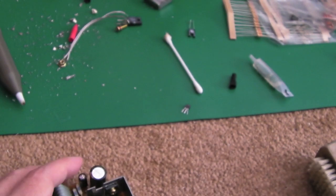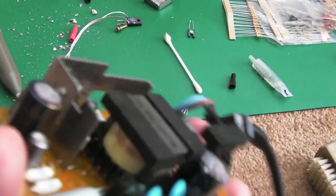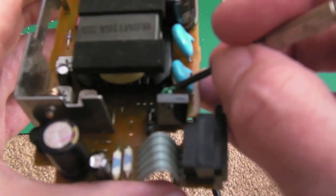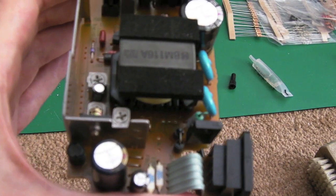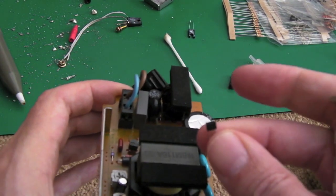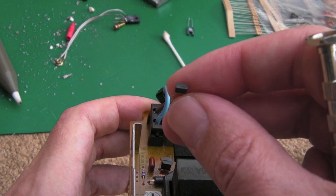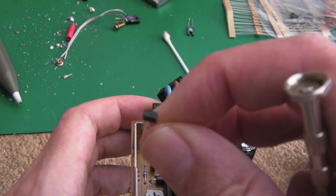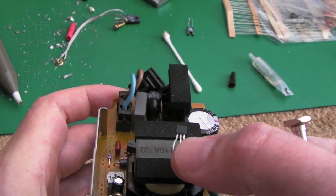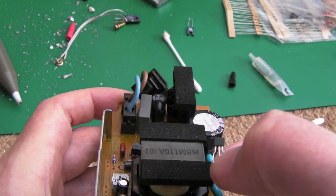I thought, oh, maybe we're lacking the 12 volts. So I then went away and started looking at the secondary side of this, the output side, in particular the component down here. It's marked Q something on the board. It looks like a transistor designation in terms of the board marking, but I'm sure it's actually not a transistor. I'll show you the component I took off, and it's marked N4218, and it's kind of a square, so the focus doesn't look very clever on this camera this morning, I don't know why. It's a square, rectangular type component, it's not got the semicircled back. Now, measuring that, I can measure what look like Schottky diodes across two of the pins, which is correct regards it being a transistor of some type.